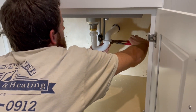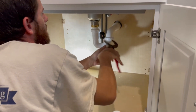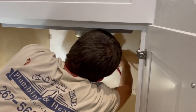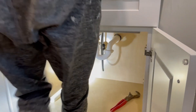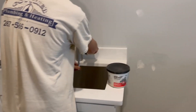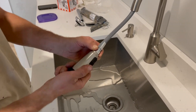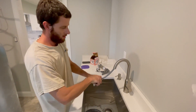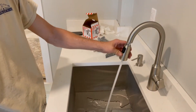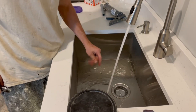Make sure the handle is off, then turn the valves on. Come back up — you're going to want to disconnect the sprayer beforehand, blow it out, turn it off, then reconnect. They give you a spot for your adjustables on the faucet head — give it a little snug, just make sure you're on the correct spot. Turn it on and test your spray options. The best way to test is to fill the sink and let it drain. Do that a couple times — and that's how you install a laundry sink faucet with a Moen kitchen faucet and drain assembly.